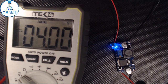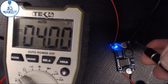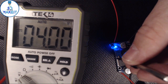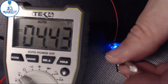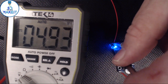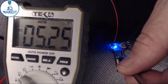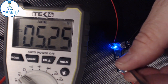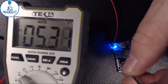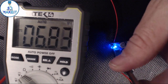So I have my meter hooked up. I've put some tape over the light because it was quite bright and it was blinding the camera, so I'm going to adjust the pot here. And as I turn it, you can see you can adjust the voltage to get it just right. So let's say I had a 5 volt Noctua fan — well now it works with my 3D printer. So buck converters are very handy for adjusting your voltage. I can even go all the way up to 12 volts.